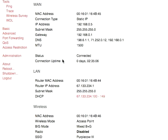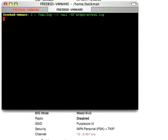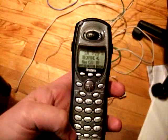We have the web server running and our network set up correctly. Now we are going to watch as our unit, hopefully, will reboot and access our web server. To do this, pick up your phone, which is plugged into your SPA-2102R phone line 1.